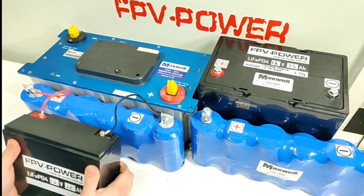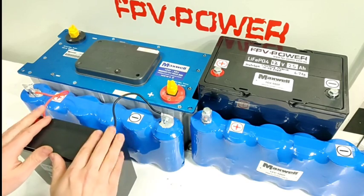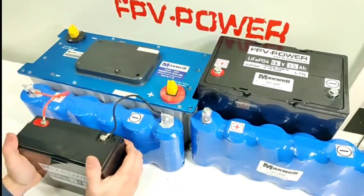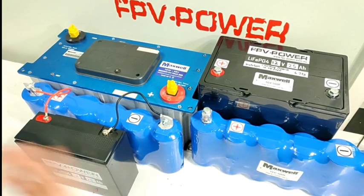With 20 amp hours, you're not lacking power to crank. So that's why it's fantastic to put a supercapacitor in parallel to an existing battery. Even better, lithium iron phosphate. The point of this video is we're trying to get away, as boaters, from the lead batteries. Lead batteries are heavy, they are high maintenance, and they can be unreliable at times when not looked after.